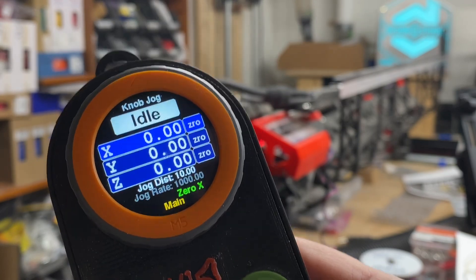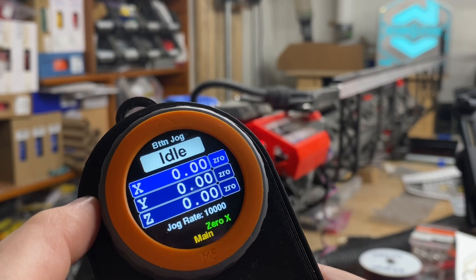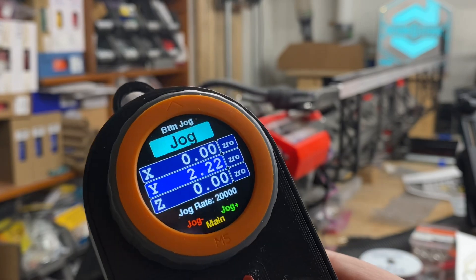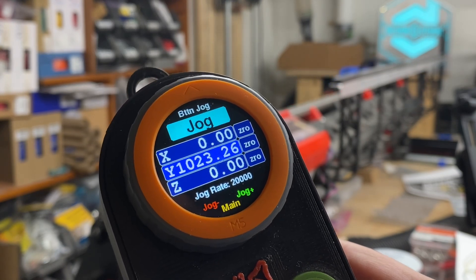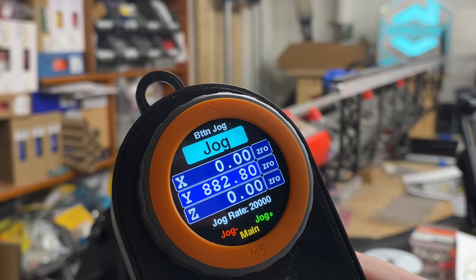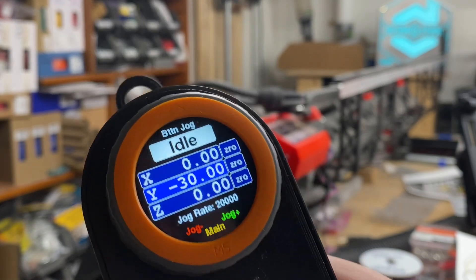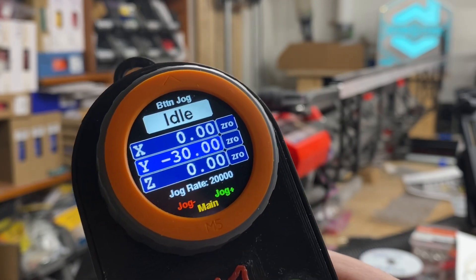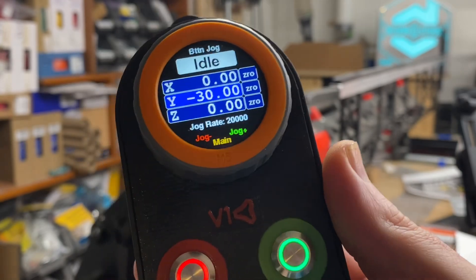Now that I've used a soft reset of my zero in the X and Y, the question is: did I lose my soft and hard end stops? I'm going to go back to button jogging and swing the Y — which for most of you would be X. And the answer is, I still have soft limits, and I still have hard limits — and you see it went into a negative number to get there. This is very good news, and I think it's what Ryan is hoping for. This has been Doug with Design8Studio, and until the next video, I wish you happy making.